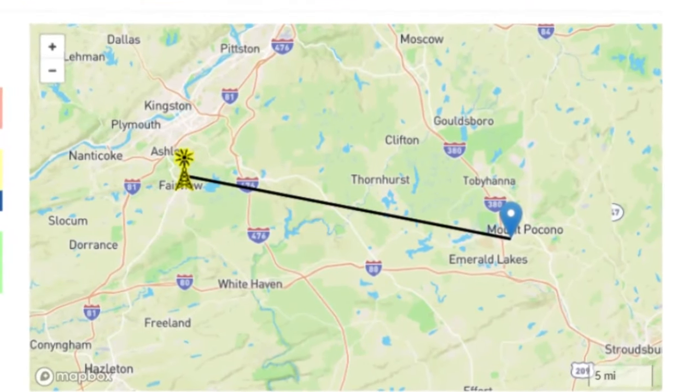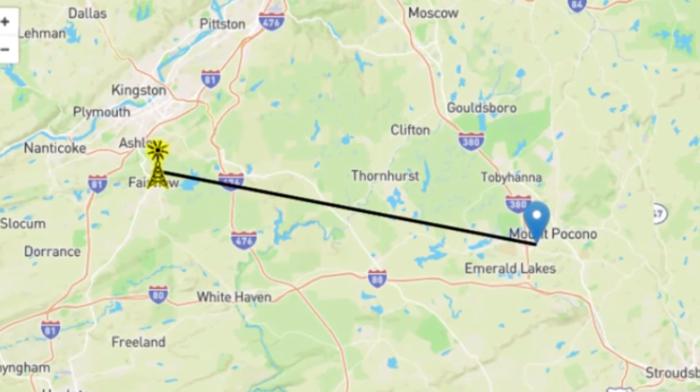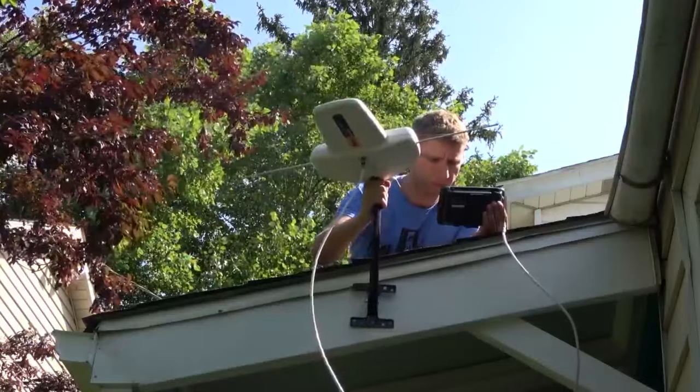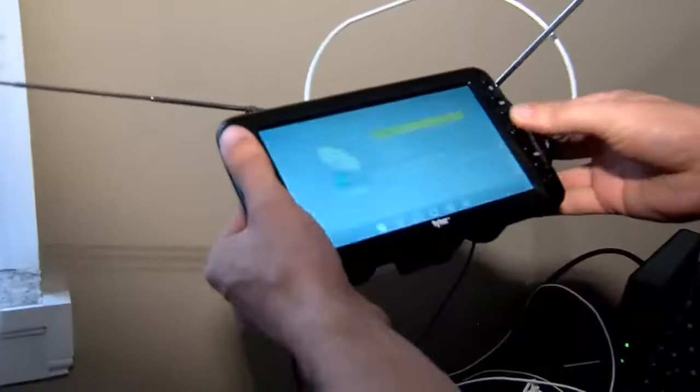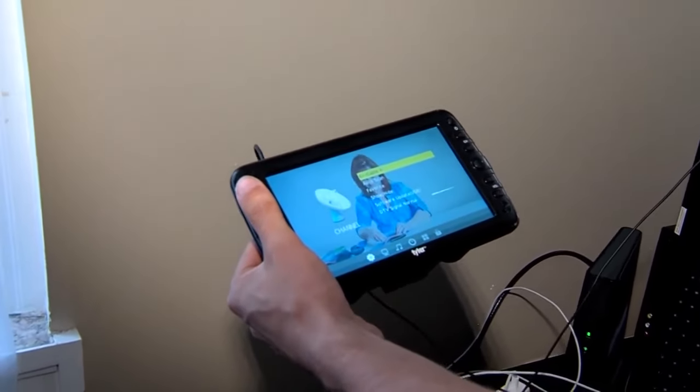For example, a home 20 to 25 miles away from the signal towers would only need an indoor or small outdoor antenna. Tyler says most of the time, homes in our area tend to need a medium-sized antenna and a small amp to ensure the best results. You want to make sure that the antenna you purchase has a VHF element, which is a long, wide, rabbit-ear kind of style element. Sometimes a flat antenna will work for lower frequencies if the signal is strong enough, but it's ideal to have a VHF-capable antenna.